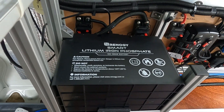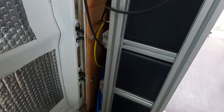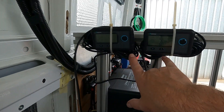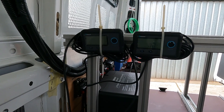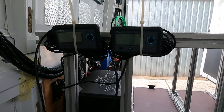I chose Renogy smart lithium phosphate batteries because not only did they fit exactly in the space I had available, but the batteries communicate with each other via USB cable and USB ports. Both sets of batteries also communicate with two devices up here which tell me their state of charge, the amperage that's been used through them, and their voltage. The batteries can be put to sleep by pressing these buttons, so when they're not in use I can protect them by putting them into shelf mode. So that's my two DC to DC systems and two solar systems installed and charging these batteries. We've got no household appliances running off these batteries yet, but it won't be long before we've got one or two of those installed.